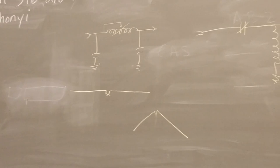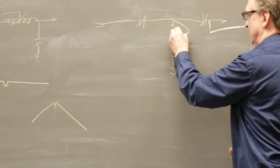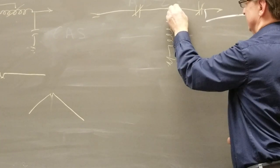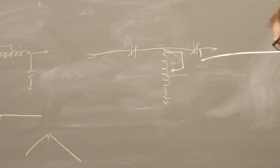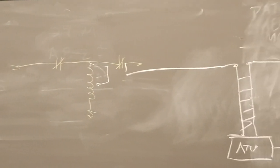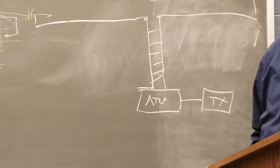Maybe we had 25-foot fiberglass whips, and at the base we had a metal box. And the roller inductor was 21 feet of silver wire, and the motor would run it on the spool and then back off. And that would tune from 2 to 30 megs at 1,000 or 500 watts. Right, but that was right at the base of the antenna.